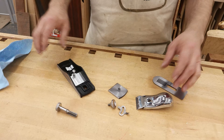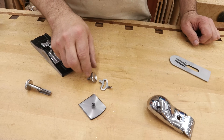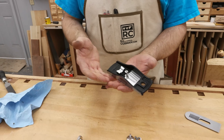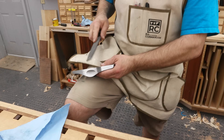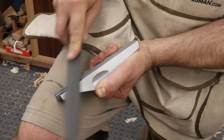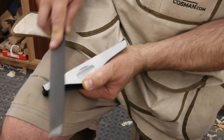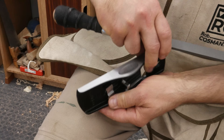I've taken this apart — there's not a whole lot to it. Nothing to do with the lever cap, though I'm going to do some work to the blade. Nothing to do with the toe plate or the throat mechanism — none of that needs to be dressed. However, because it's a block plane, you tend to have your hand all over it, so I want these edges to be eased just for comfort. I'll take a file and start by filing a 45 degree chamfer on there, always working away from the sole so any burr isn't on the side that makes contact with the wood. I'll keep changing the angle so it cuts more of a radius — a lot easier on the thumb and fingers. Do both sides.